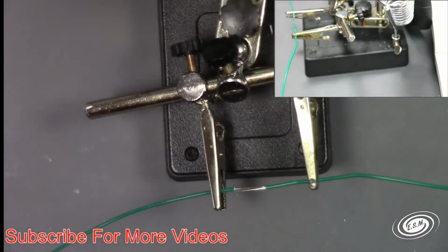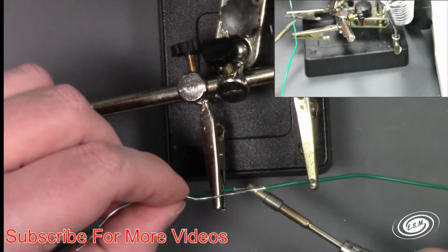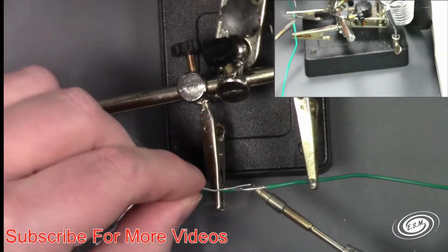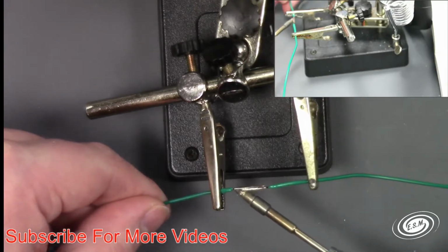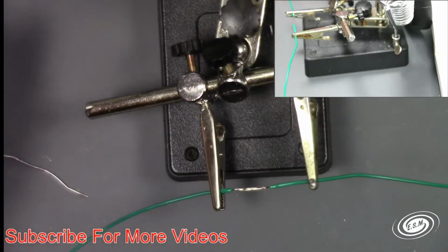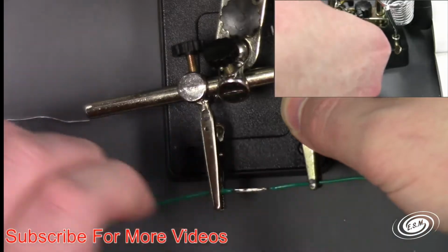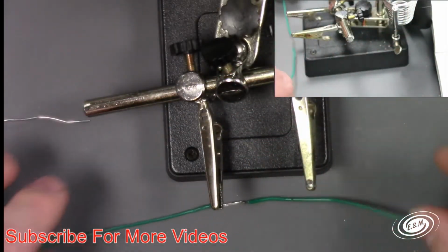Is that in the shot all lined up? My soldering iron should be hot. I'm going to grab my thicker solder because I don't need the thin stuff. So I'm going to take my soldering iron and I'm going to touch it to these two right here. I'm going to add a little bit of solder to my soldering iron. And I'm going to flow these two joints here. There we go. Let that cool down, and that is soldered together. We'll check that. Now that is bonded together, so we'll get the helping hands out of here.